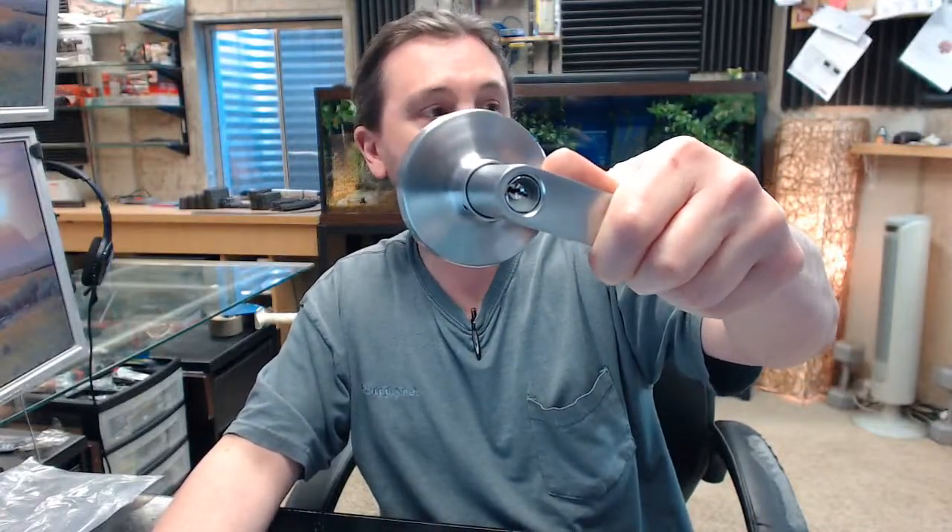Options you're going to have on this sort of trim include knob trim, a storeroom function where the trim is always rigid and you always need the key to come in, or a passage function for an interior door in a path of emergency exit that always needs to be accessible. There is a link below this video to the manufacturer's page where you can pull up the catalog from Ultra Hardware and view their entire comprehensive line of commercial hardware, exit devices, door closers, lock sets, hinges, and residential and cabinet hardware as well. Any questions on the Ultra Hardware number 02053 or any other Ultra Hardware product, please feel free to reach out to us. Thank you.